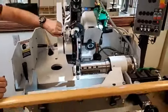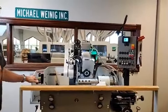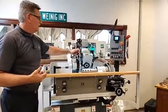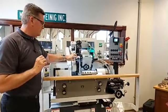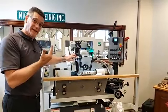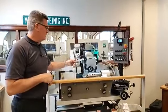Okay. For some of you guys that stand in front of a grinder every day, we have different types of diamond dressers that we put in here. What comes with the machine from the factory is just a single point diamond. They tend to wear a little bit quick, and then you have just kind of a flat, non-pointed diamond. So it does dress a little bit aggressively.